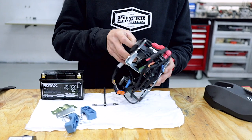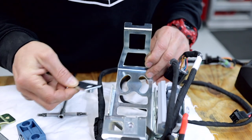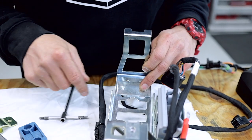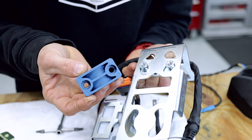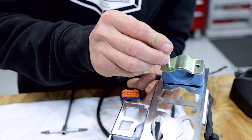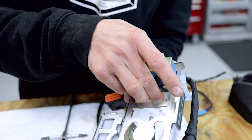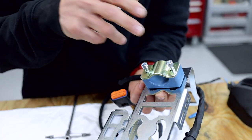Unwrap the harness — it comes all wound together. Now we're ready to install the chassis mounting clamps. Grab the nutserted steel inserts and they just fit inside here. They can rotate in the sheet metal. On the bottom you can see they are sticking through, and the little isolator mounting blocks just fit straight on. Then you can put on the bottom clamp and hold it in position with a couple of loose bolts — I like to put them in here so I can get the battery bracket all assembled and it doesn't fall apart.